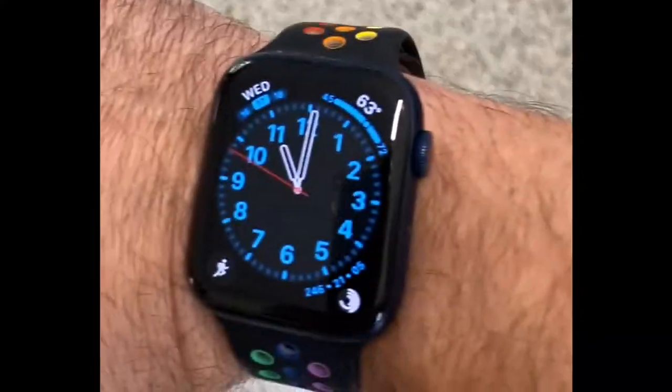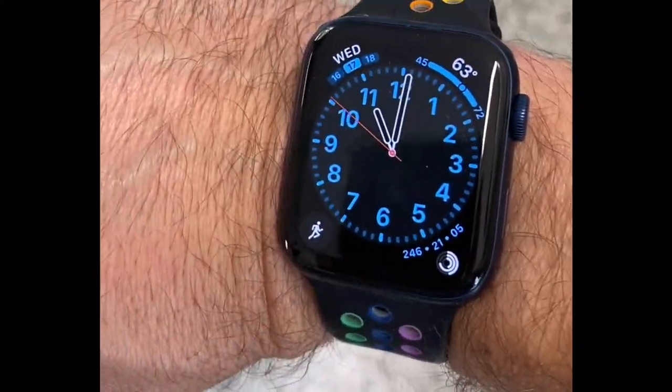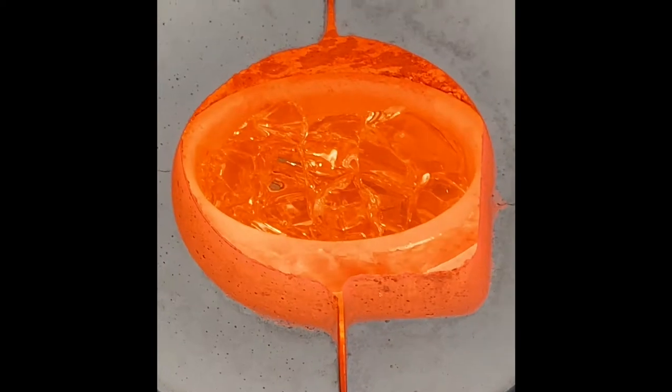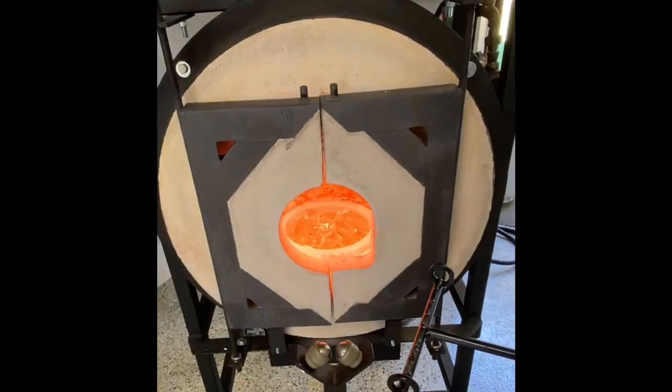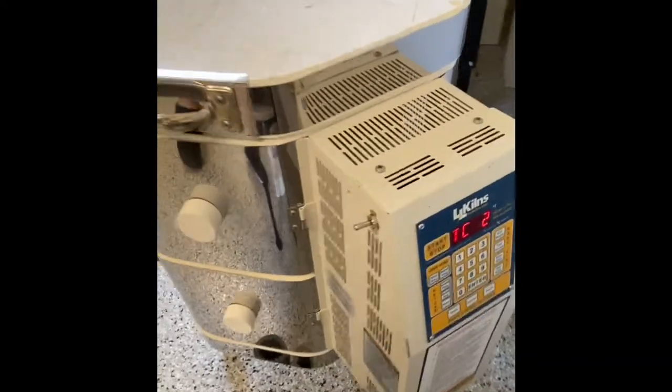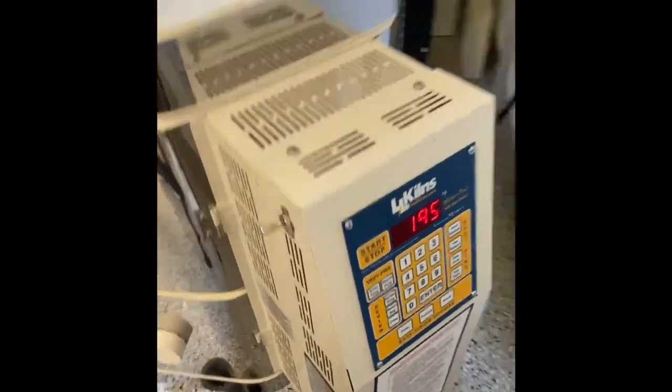The studio took them a little while to figure it out, but I just fired it up at 10:30. It's been running for half an hour now — you can see it's starting to glow and the glass is starting to get a little soft, starting to slump down into that little crucible. I believe that's a 40-pound crucible — you'll have to ask the people at Canned Heat. I've put color away for the day, so I'll use the top loader to pull a little bit of cane.